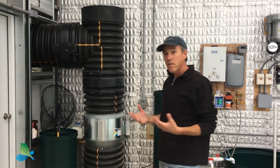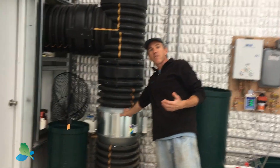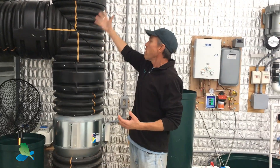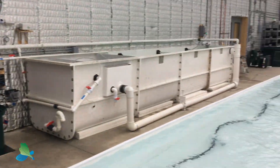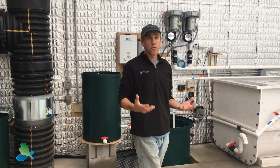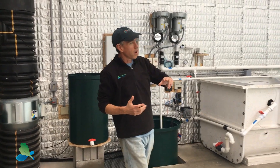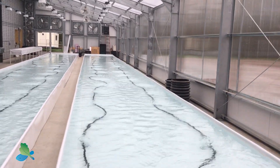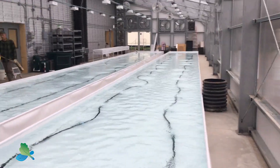There are a lot of different terms out there, but basically what's happening is there's an inline circulation fan drawing hot air in the summer down into a series of piping that's all underneath the ground, underneath the slab here, about four feet deep. That's really acting as a big thermal battery — we're using the temperature of the ground to help cool that hot air. These shorter pipes throughout the greenhouse are actually releasing cooler air out of the ground, helping to naturally cool that air.